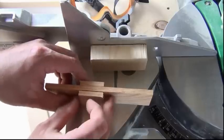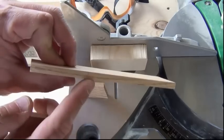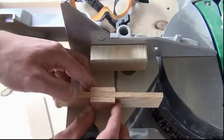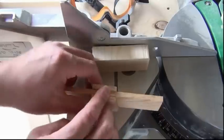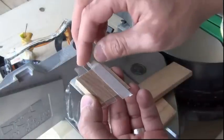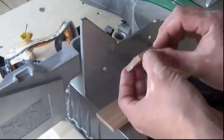I'm going to use the miter saw staging area to help me align these. I made a little mark of where I would like the top of these to align. When you're gluing, if you're a little off this way or that way it's okay, as long as either the top side or the bottom side is nice and flush. I've placed double-sided tape onto one of the pieces and I'm going to secure this against the back.